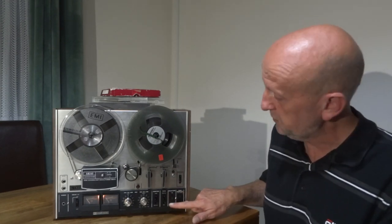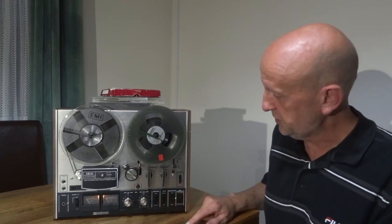So that's the recording. I think you can forget about the three and three-quarters - there's a massive difference in sound quality. For the recording setup: I had the SOS sound thing on normal, the equaliser set to three and three-quarters for the slow speed and seven and a half for the faster speed. I had the tape selector set to low noise off and wide range, which gives more dynamic wide range. I had the Dolby off for both recording and playback. I kept the record level exactly the same for both speeds.